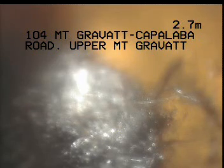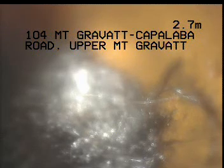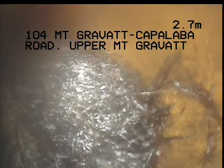I've just cleared the blockage with a jet, but there's still some remnants here. It could be a root intrusion breaking through into the drain. I'm just going to mark this location, and then I'm going to work it further and see if I can clear whatever that is. But first off, as I say, I'll do a locate.